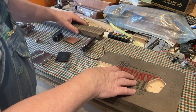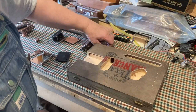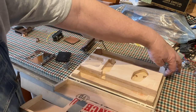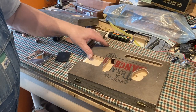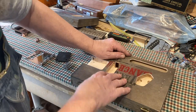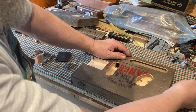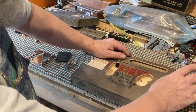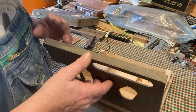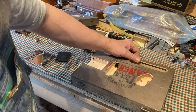What we will do, I think, with these boxes, I'll go back to the other one, because this is all routed out now. I've got wiring passages here, I've got my jack in the end, I can actually glue that all up. I don't need any more access to these voids because I can get all my wiring done there. Normally I will leave cigar boxes open, but on this occasion I think I'm going to glue everything down, then fit my hardware and wire it.